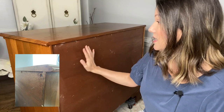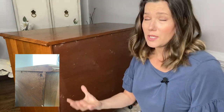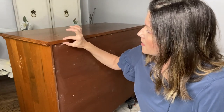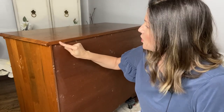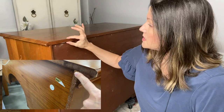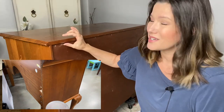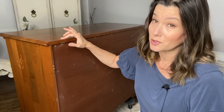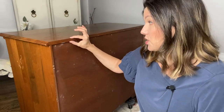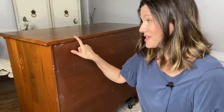The next thing you're going to look at is the top piece of wood — whether it's solid wood or veneer. How do you tell? If you look at this piece of wood from the back, this would be the actual unfinished edge of a dresser. If this was particle board, you would see wood veneer — particle board with wood veneer on top. Wood veneer is a layer of wood that sits on top of a different kind of wood; it's basically the cheap way of making something look high-end. By turning this around and looking at the back, you can see that this is solid wood.